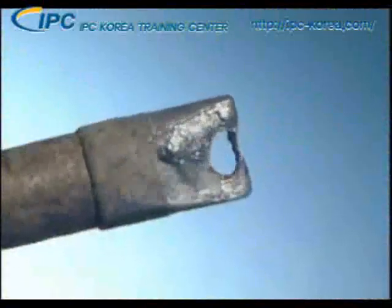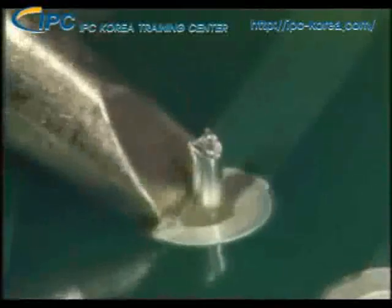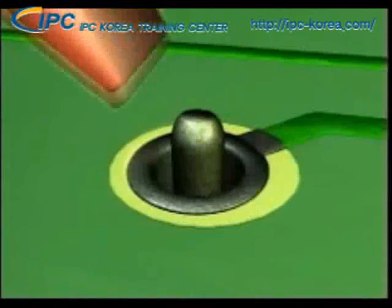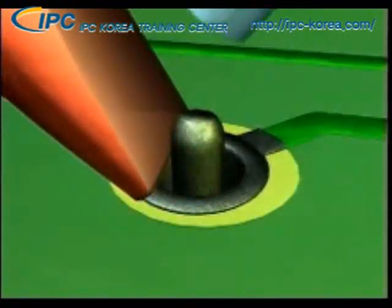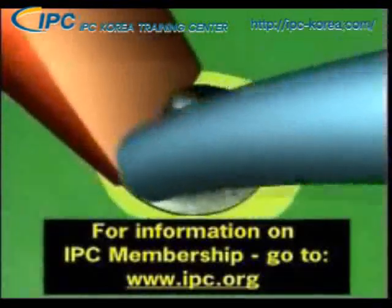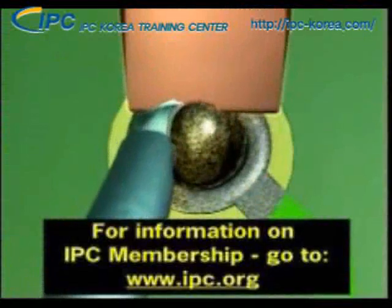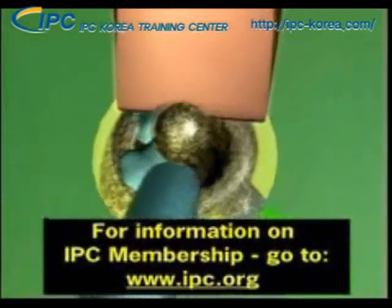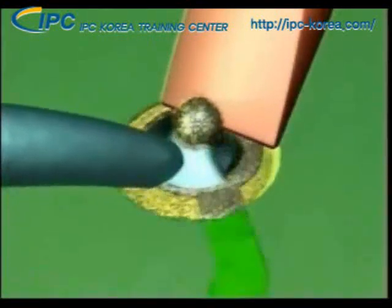These are examples of tips that have been damaged from feeding solder directly onto the tip. The best way to protect the tip and create the most efficient heat transfer is to use a solder heat bridge. To do this, the tip of the iron is applied to the junction of the land and the lead to be soldered, which starts the heat flowing to the connection area. The heat bridge is formed by touching the solder to the same junction, then moving the solder wire over to the opposite side of the land. This causes the liquid solder to move toward the heat source to complete the solder joint.